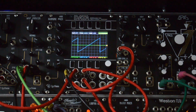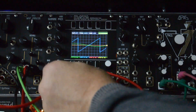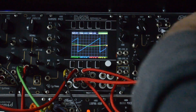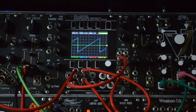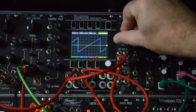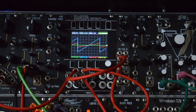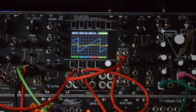The AI26 can also do the opposite: take a Eurorack-level signal and output it at line level. So you take your Eurorack-level in — we'll grab that VCO signal — put that to the Eurorack-level in, and then take the line-level out. We see that on the red line now. When you turn it all the way up, that plus or minus five volt signal — which should be the max you're generating from your Eurorack system — becomes the plus or minus two volt signal that your sampler, MPC, or DAW audio interface would be expecting.